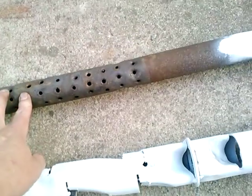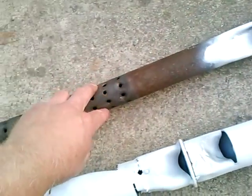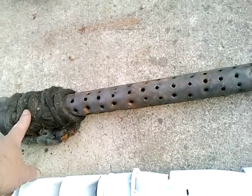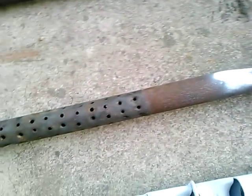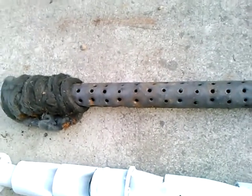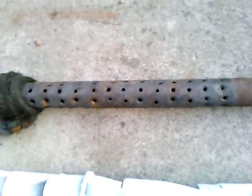The first thing I tried was this: with a one and three quarter inch diameter tube, I made a full scoop so 100% of the exhaust is forced into the space, and then to get out it has to flow through these holes. Many of these, when I install them, I include some steel wool, figuring there's sound bouncing around in here that I can attenuate. This was louder than I expected — maybe I included too many holes — and it also had an odd metallic clicking sound on the overrun. If the engine was revved up and as it slowed down, I don't know if this was making the ticking sound or failing to quiet it, but it was very noticeable.